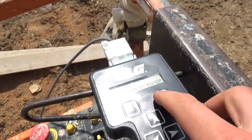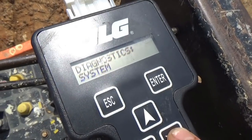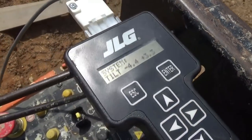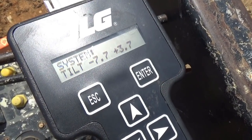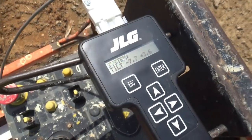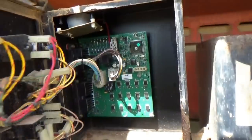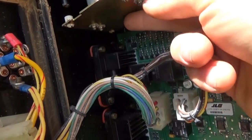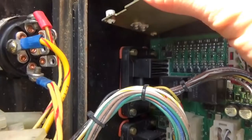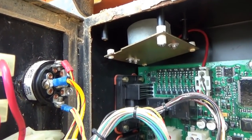But this level function — if we go back to see everything okay, diagnostics, system — this tilt, if we let ourselves back down, that should be close to zero if we're on level ground, which we pretty much are. So let's find this tilt sensor and do a visual inspection on it. Well — visual inspection in the control box — I think we found our problem with the tilt sensor. It's supposed to be held on by four bolts and it's barely held on by one. You can see it's either rusted off — how does that even happen? — that one's stripped out. Let's at least try to fix this and see if we solve that pressure transducer fault.